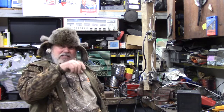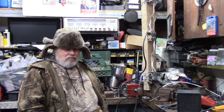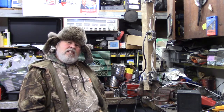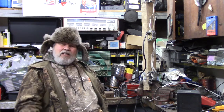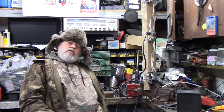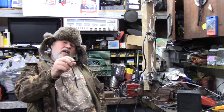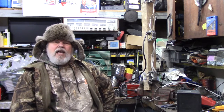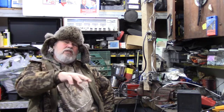Most of them have safeguards like thermal cutouts built in, and if they fall over, they kick out. I think the safest ones are the oil-based ones, built more or less like a hot water tank with an immersed element in them. The worst ones are the radiant ones and ones with the tubes. I've seen those tubes all of a sudden just blow. The old stove elements used to do that. Those tubes are more or less the same thing as those circular elements that used to be in the stove.